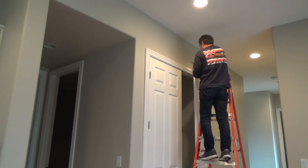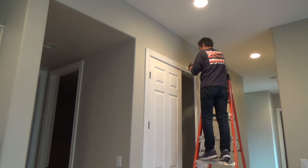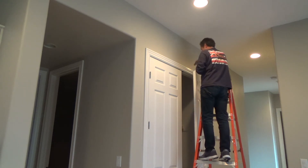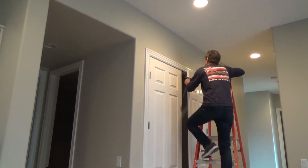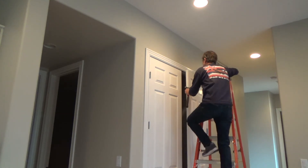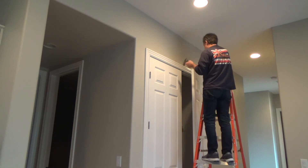I know I need to go up at least so that ridge is flush with the top edge of the door. It's coming a lot easier now — just tap, tap, tap. Now I can grab it and unscrew it a little bit. I've got it just about where I want it. If you can't unscrew it with your fingers, that's okay — just keep taking your nail set and tap on it some more. I've got it just about right.